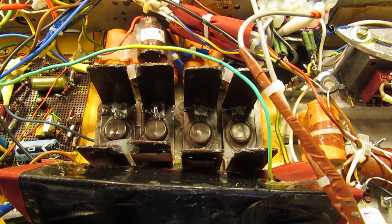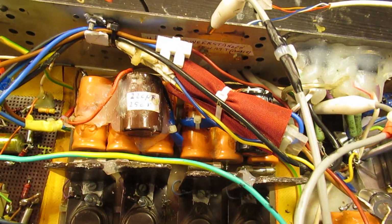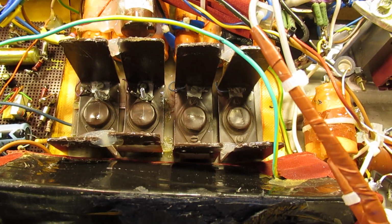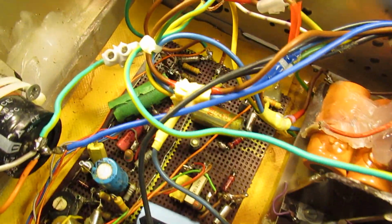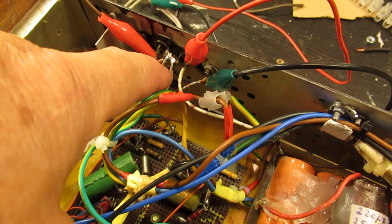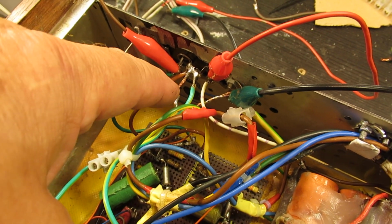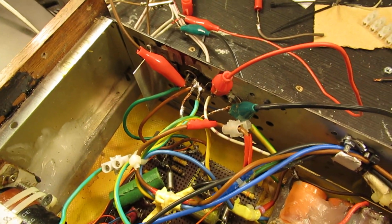that is one of the properties of such a very simple setup that everyone can make and is very durable. The preamplifier is here. I can drive in here approximately 100 millivolts, so 0.1 volt AC audio signal. And well, let's listen.